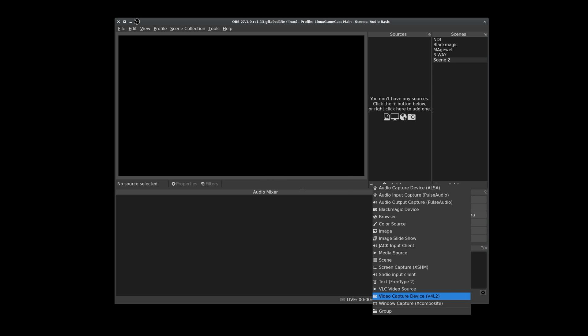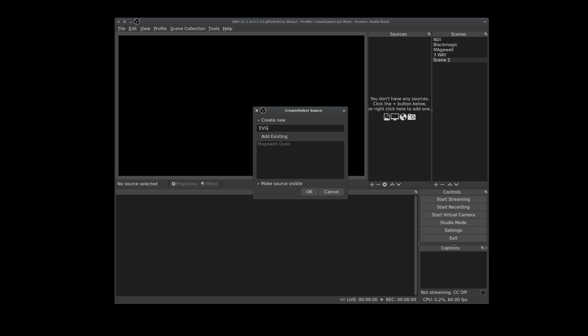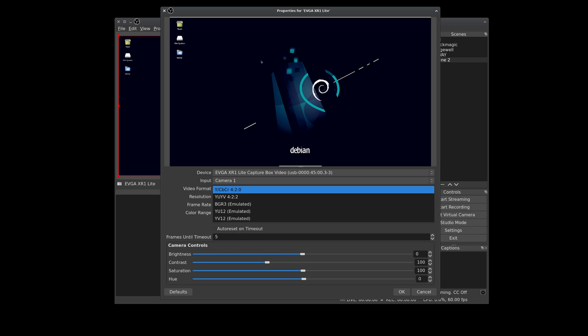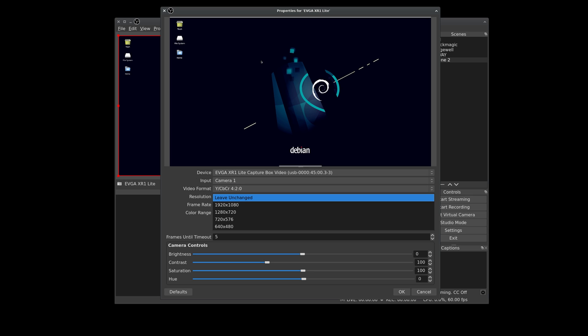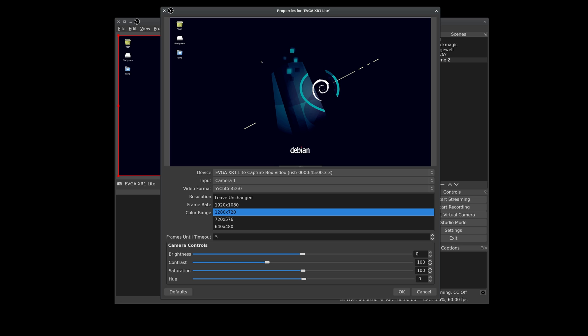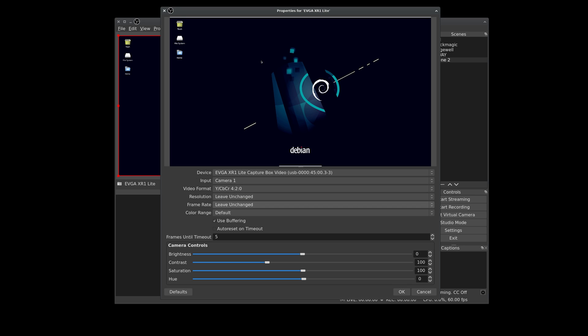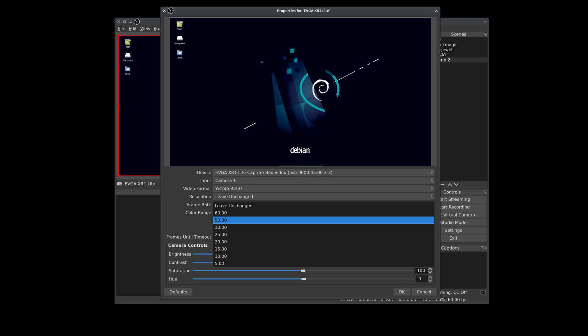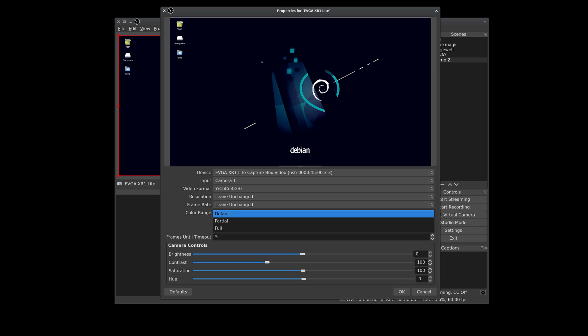Video capture device, V4L2. This thing should just show up as a webcam. We can name it whatever we want. Just add it to your sources and hit OK. And there it is — I have it plugged into one of the extra boxes in the studio, and it showed up like I would expect it to. Look at that, 60 right out of the box. You can always just move around the cursor and immediately feel where you're at. Video formats — that's standard. Resolutions, 480 to 1080. Everything it says it was going to do. What do we have for frame rates though? All the way down to 5, all the way up to 60. Color range is probably just going to be full and partial, but that is also good.